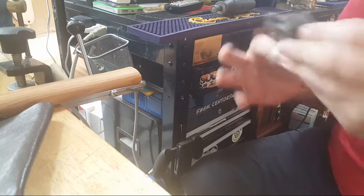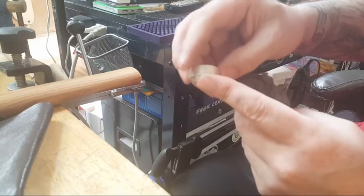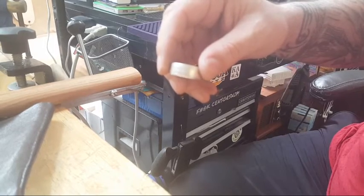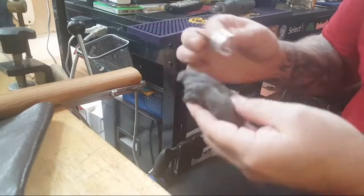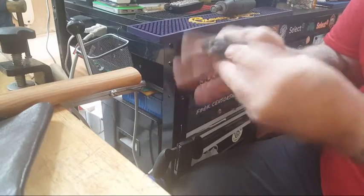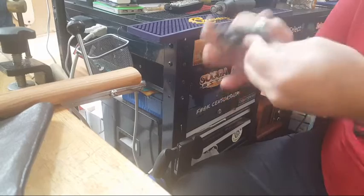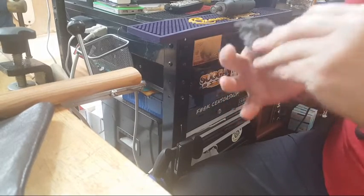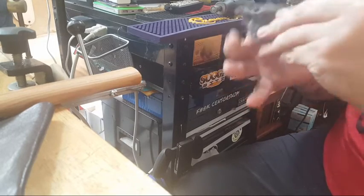And this is more or less just kind of taking the frost, because there's like a little frost on this side, which is kind of hard to capture right now. But it's just a little frostier, so when I patina it, it'll stick better. You can always just throw it right in the patina solution, but you'll get some blotchiness, some spots, anywhere that my fingerprints hit, it won't stick as well. Little stuff like that.